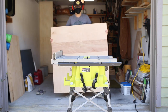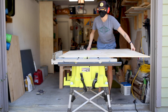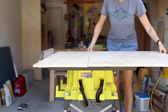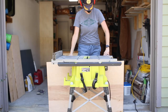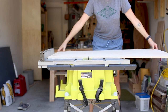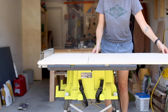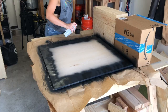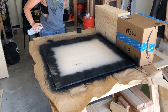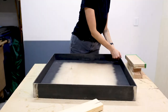Back in my shop, I broke down some half inch plywood on my table saw. This will attach to the back of the mirror and is what attaches the mirror to the frame. I'll have an article on my website with all of the dimensions and cuts if you'd like to make this yourself. I cut the plywood about a quarter inch wider than my mirror so that when I attach the plywood to the back of the mirror, the mirror will set just slightly away from the metal frame. Because this produces a slight reveal of the plywood backer, we spray painted the outer edges black so it doesn't show.